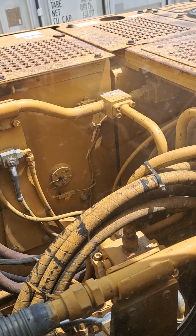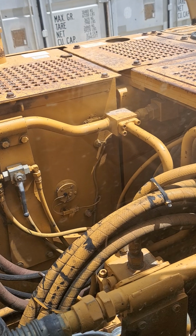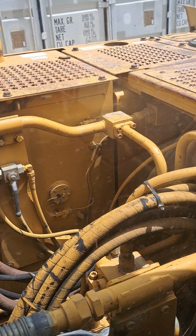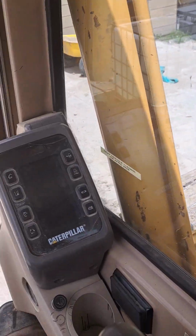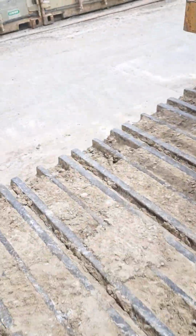And then we'd want flow both directions back to tank, so we might have to gut that ball valve too. Well, no, actually, you could just leave the ball valve open. That would provide a parallel return path for some of the oil, and that may help in reducing return restriction. So that's the function of that fourth ball valve. Now there's a fifth ball valve that we haven't looked at in any detail, and that's the one on the back side.